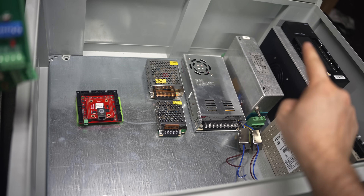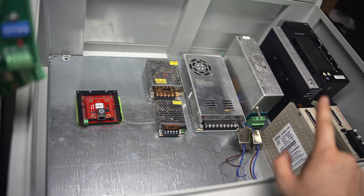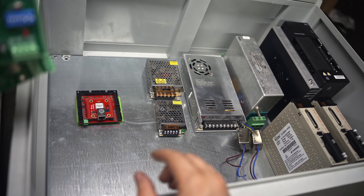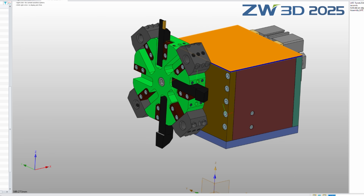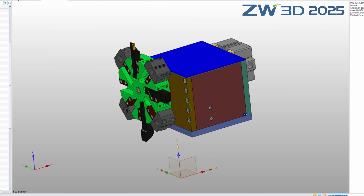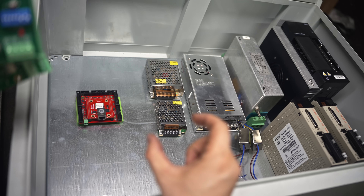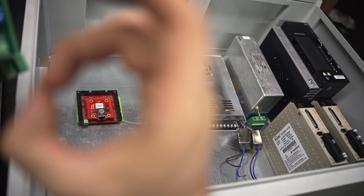That big black device will supply current and control the spindle motor. The EMI is here to guard our whole cabinet from disastrous electrical noise which can be caused by the crazy servo drive - the same goes with the smaller 750-watt ones. The big 24-volt power supply will work together with the relay coils and the ATC stepper motor. The same voltage is on the smaller PSU, but I will use it for all the LEDs, buttons on the control panel, and generally speaking, low current stuff.